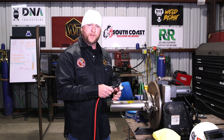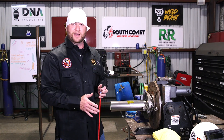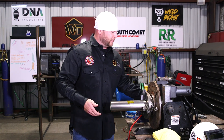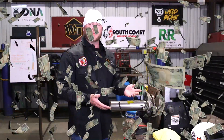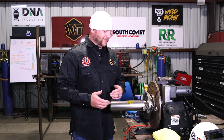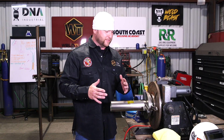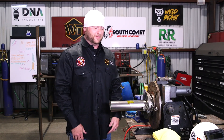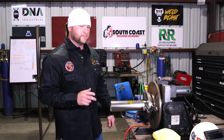Sure, if you have some blueing you can come back and get rid of it, but why even waste your time? If you're doing an exotic exhaust — sometimes these cars it's $10,000 or $12,000 for a custom system — you're bidding that job, so how fast you get it done is how much money you're going to make. It's not an hourly gig. Using the trailing shield, a couple-hundred-dollar investment, it's going to put a lot more money in your pocket. We'll see the difference between the two — hopefully you guys get something out of it. So let's get set up and start burning some rod.